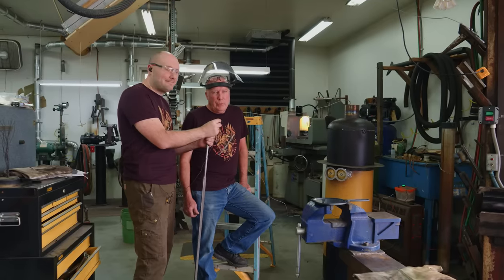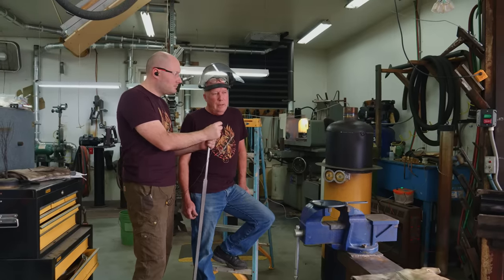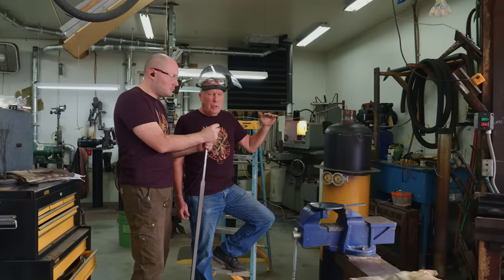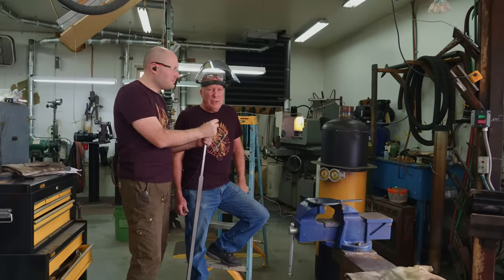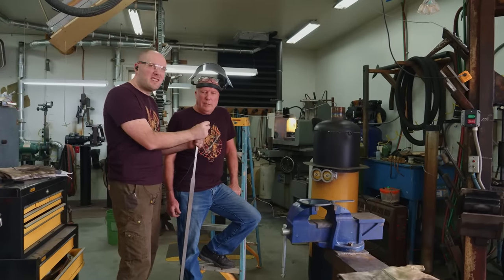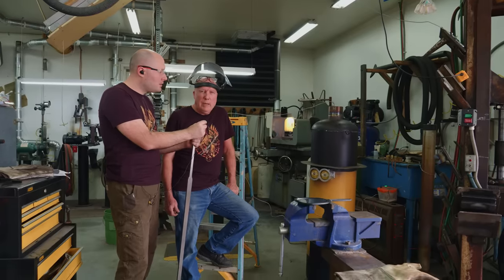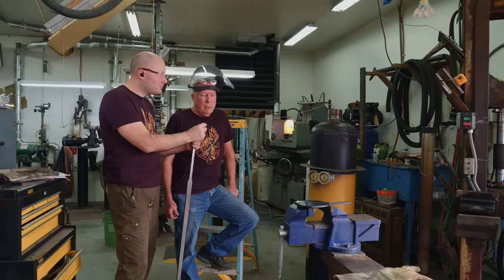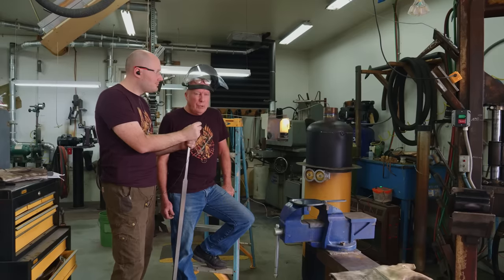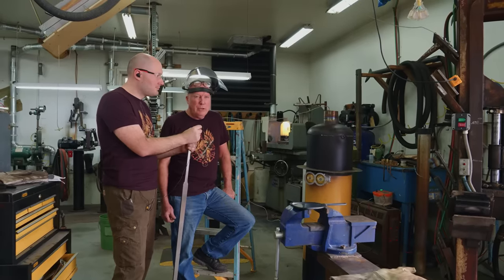It's pretty incredible. Tell us some of the benefits about heat treating and normalizing with salts, Dad. The heat transfers through salt and sand very well. The salt we're using here, it's 52, 54 inches of salt, and our temperature variation is gonna be nominal. And it protects the steel, right? It protects the steel during the heat treat process, and it doesn't develop any mill scale. So you can almost have a semi-finished blade and be able to heat treat without the worry of excessive mill scale on your semi-finished blade.